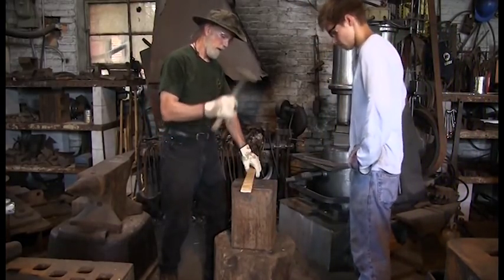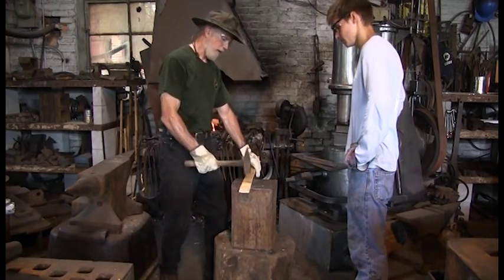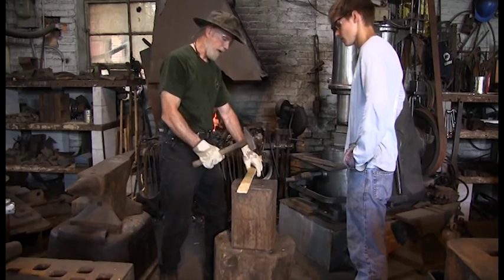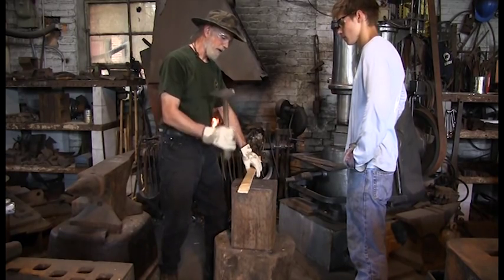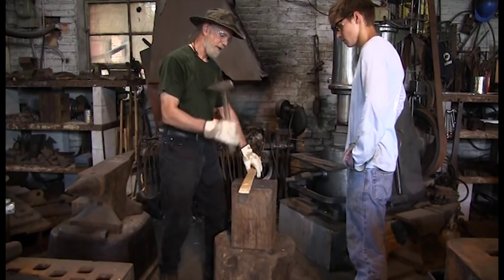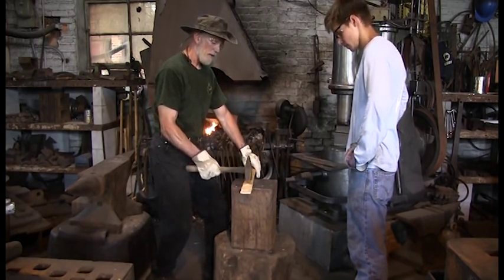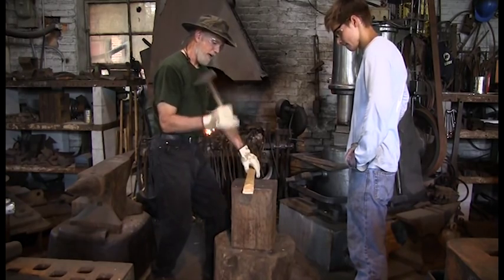We concentrated on cocking the hammer for the full arm swing for maximum power. But I also demonstrated this super useful variation. Here I am snapping the hammer with no upper arm movement. This technique allows you to hammer effectively from any position. I've pegged my elbow now, and I can still hit.